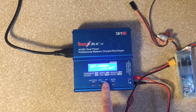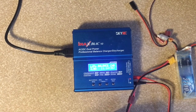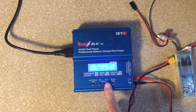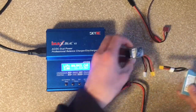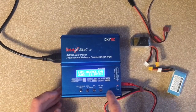I don't use that function ever. So I usually just use LiPo battery. We'll just push start and then it goes back to this. If you arrow through here you can see fast charge, storage, discharge, balance charge. I'm never in a hurry so I just use the balance charge — I think that's the best one. It's a different charge type. I've got two XT30 batteries here and one of them's dead, so we can use the inboard battery meter.